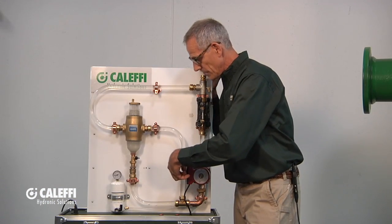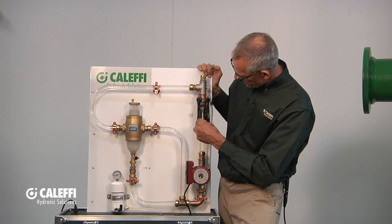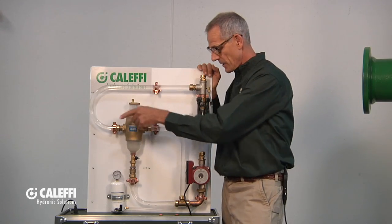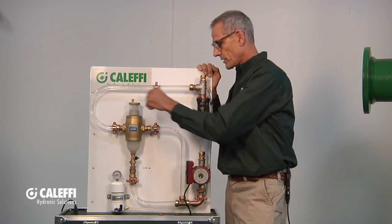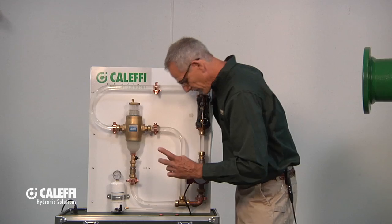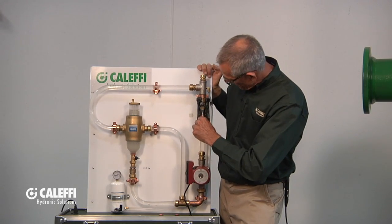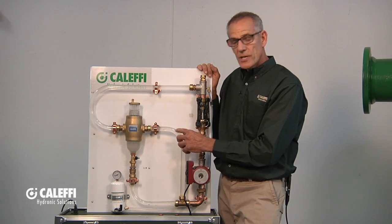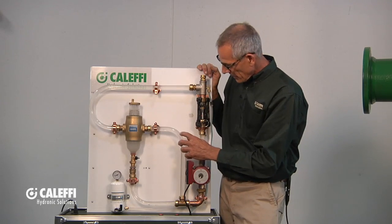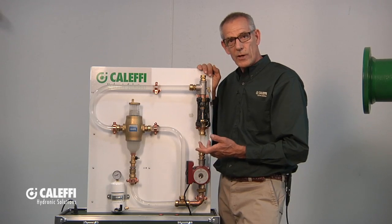Even at the higher speeds, we'll increase the velocity through that. Let's go up to speed number two. Now we've taken our flow up to just under 6 GPM. Still doing an excellent job — only a bit of air is getting through that separator on the first pass, which is amazing. It's scrubbing it all out as quickly as that pump's putting it in there. Now on speed three, we're up a little bit over 7 GPM. You can see we've still got air coming out of the Disco Dirt. Big bubbles going in there and very little air is getting through. That goes to show you how well this device works.